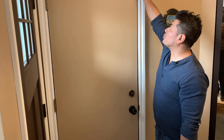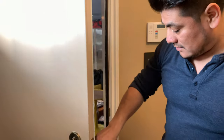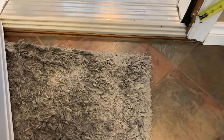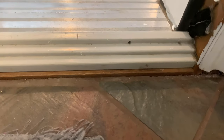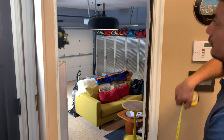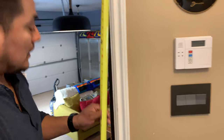The next measurement is the height. Again, I made that three-quarter mark on the top edge up here. If you notice, on this door we already have finished flooring, so we know that the door drops down a little bit lower than this. That's fine — you don't really need to worry about that. We're going to take the measurement right from the floor to our mark at the top.